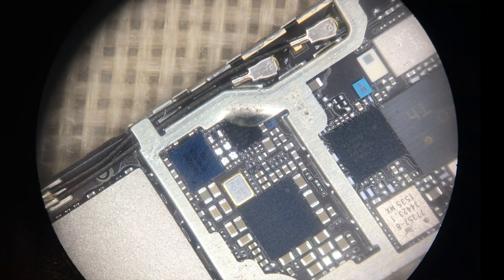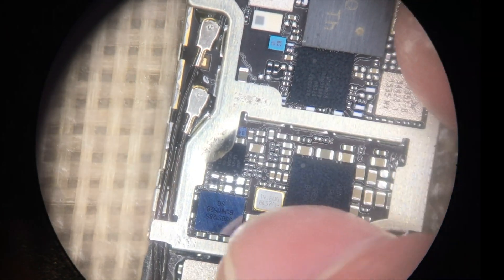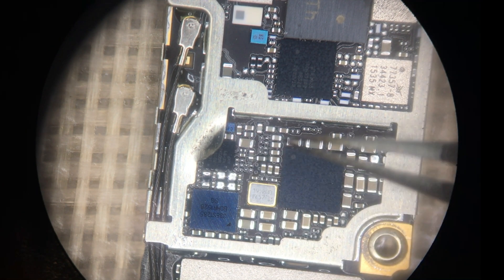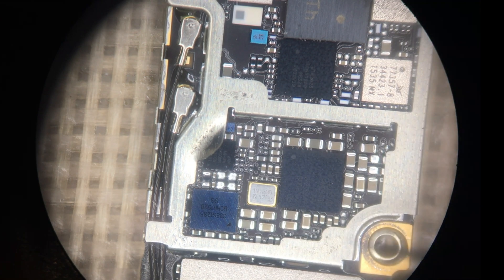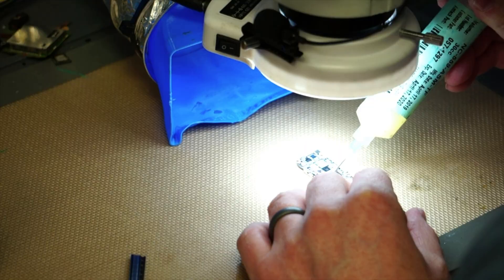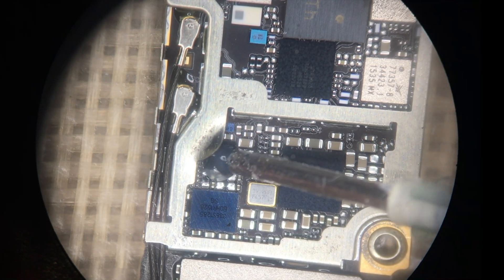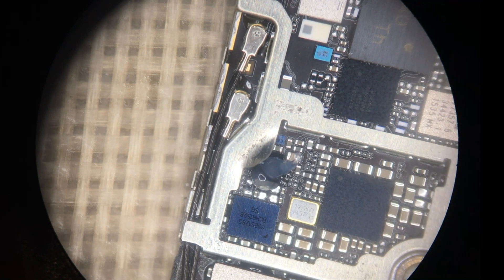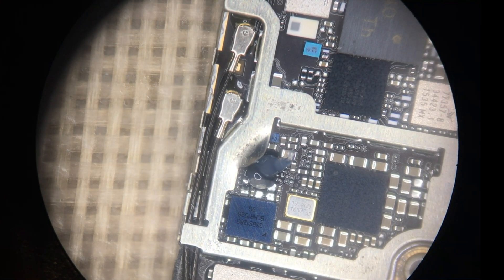This particular TriStar is most likely bad. Depending on the chip, it could be that the IC itself has gone bad or that the solder ball joints underneath have gone bad. However, in a situation where TriStar is not working properly, it's never going to be the solder joint — it's going to be the IC itself. So you want to pull it off, discard it, and replace it with a brand new IC.